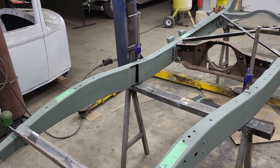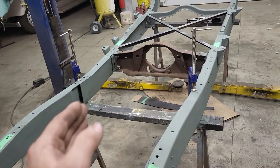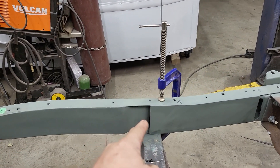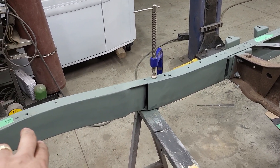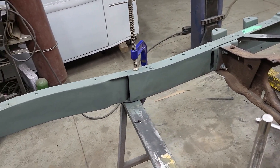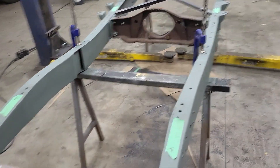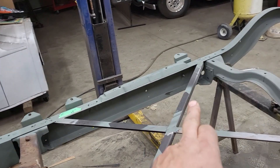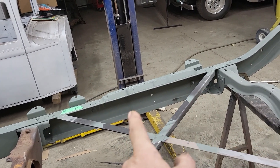So far it's turning out just spectacular. I really love these pockets because my fuel line can run in and through there. They do overlap — that turn-in is really nice so it's not going to chafe as I bring fuel, brake lines, wiring, or anything through either side. I can keep them tucked in, keep them hidden, and give it a nice clean look and keep it protected.